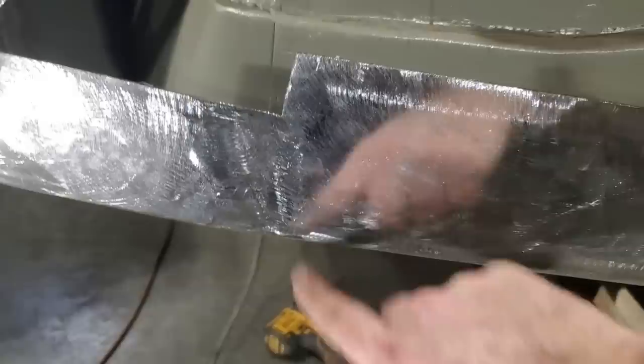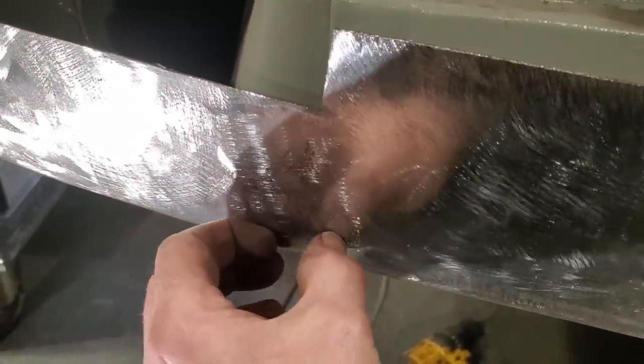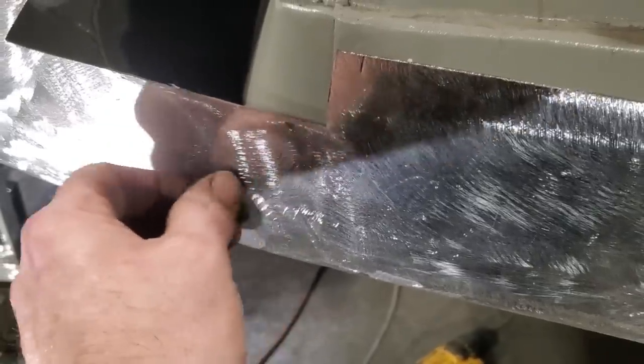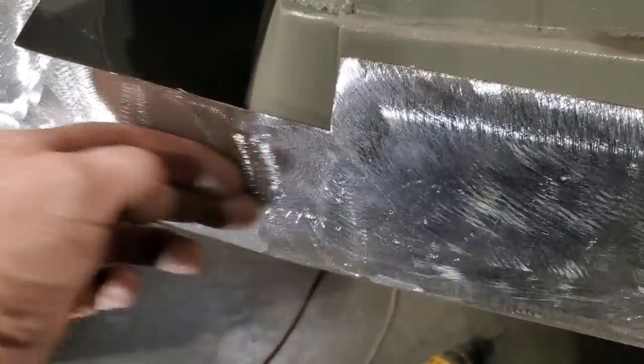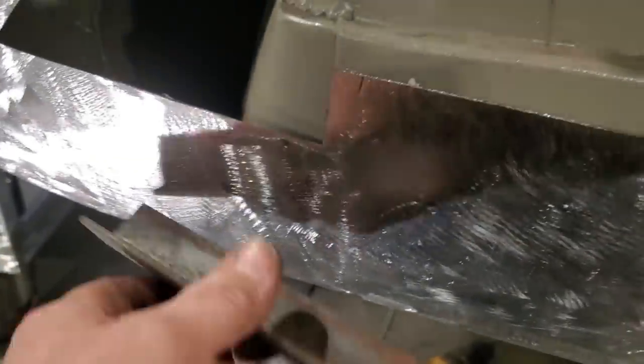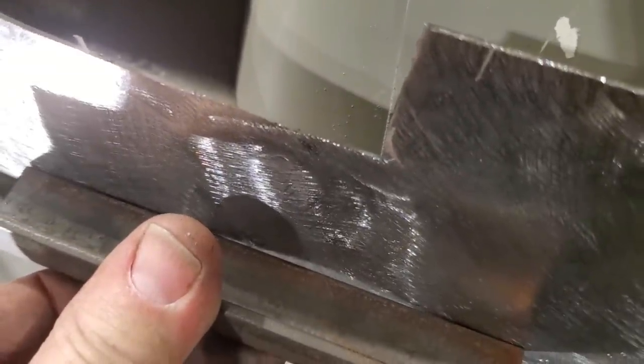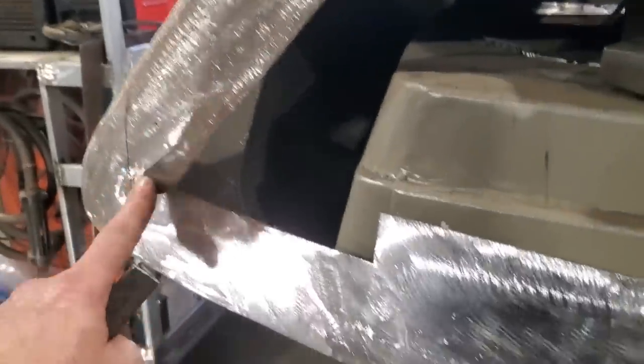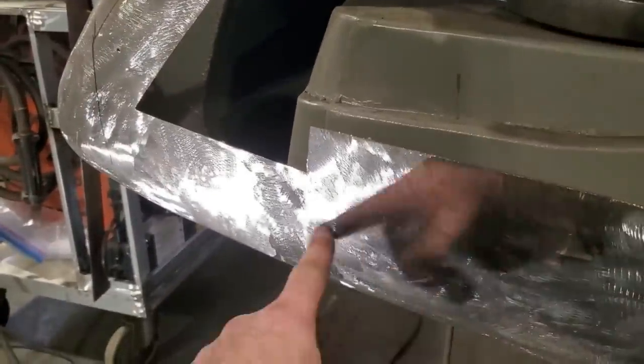All right? And what I mean by tucking is that right where I welded it, there's a space probably about this wide going right up through the whole panel there. Now that's got probably about a 1/16 of an inch drop in it. It's not flat anymore, okay? You can actually see it there where the hole's that edge on it. And you look down through it, you can actually see the spot there. Right? The shadow.